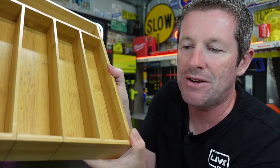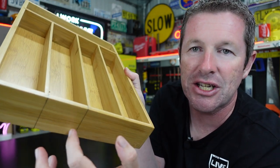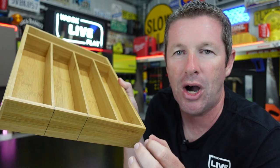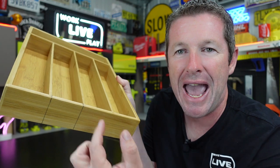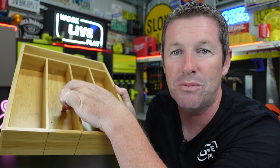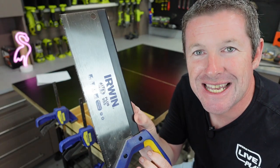But what I've also done is I've actually squared off some lines onto the section that we're going to cut out. And this is where I want to just fill in a little bit of detail because it will help you out quite a lot. So if we move back down to the workbench here, I'll show you how I went about cutting this section out so that it left it pretty much the exact width so we could move it up a little bit further. So firstly, we clamp this down onto the side of the workbench, and then I'm using a tenon saw